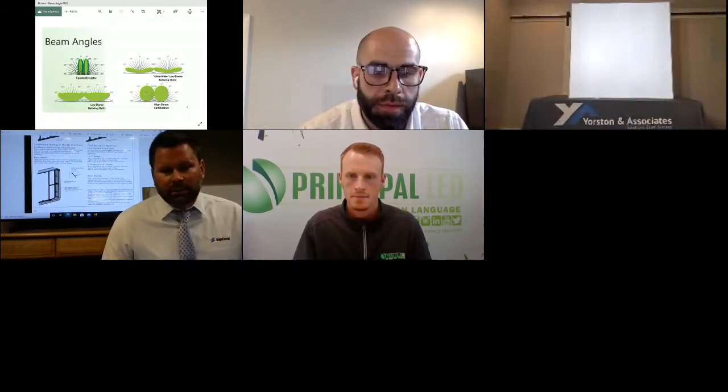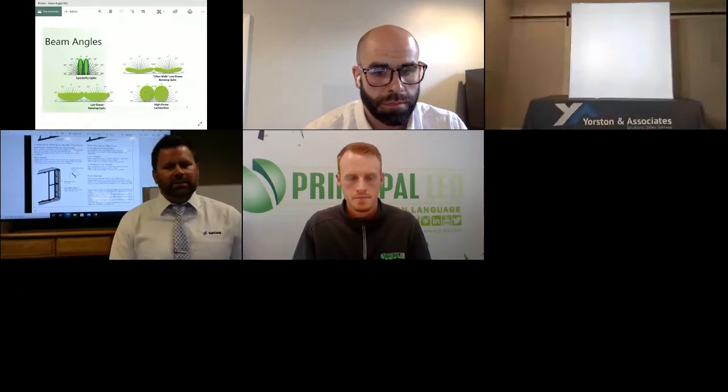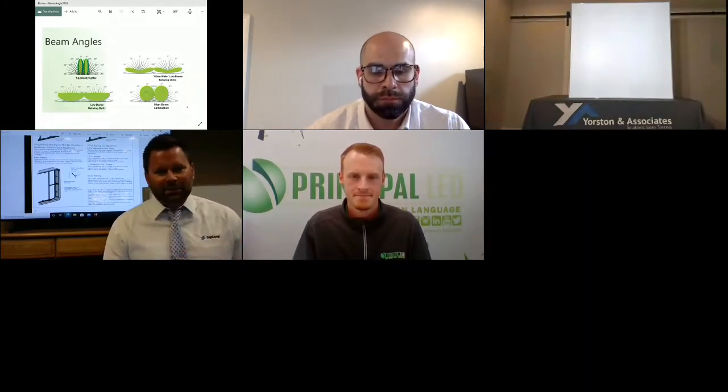Yeah, and speaking of depth, as I was mentioning before, those changes SignComp is making with our flex frames and bodies and cabinets, we even have a single-sided tensioning system that goes all the way down to 4-inch with that same 2086, a slimmer body that hinges open for service. But I'm not getting too ahead of myself here. 6-inch still seems to be the sweet spot, especially with our 2233 frame. That one is beneficial because it doesn't even have supports. It doesn't hinge open. It's an all-in-one tensioning frame with that extended leg. There are no perimeter shadow issues. All it takes is your backer supports because it's a single-sided application, but you're still at 6, and now it's not hinging open, so you don't even need our kickers or supports or anything from SignComp that can get in the way. Adam had another comment there, Joe.